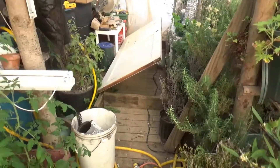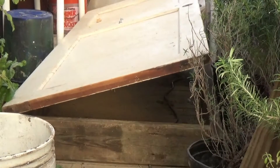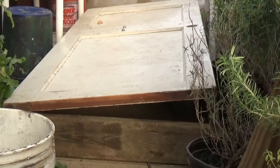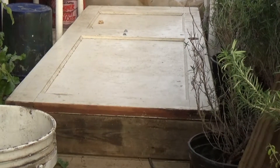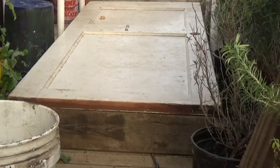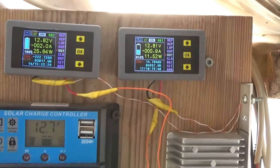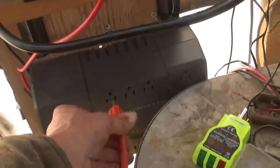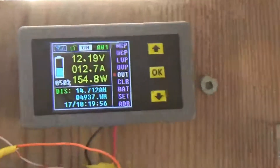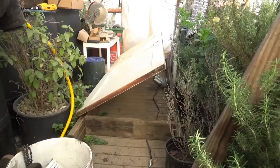You can see she's going down. Then I'll give you the demonstration going the other way — I have to manually switch the wires right now. The relay will handle the normally open, normally closed state once it's connected to the Raspberry Pi for automation. Okay, this is the next test — we're going to go up. I'll go to the wattage meter real quick to show you the wattage consumption before the up climb. You can hear it running. You can see it's drawing about 150-some watts — that's because it's charging and the meter can't do both directions. But up she goes.